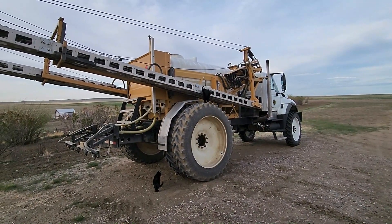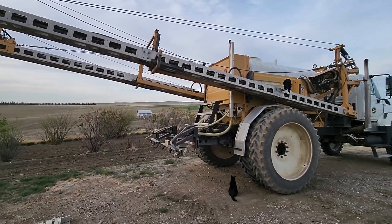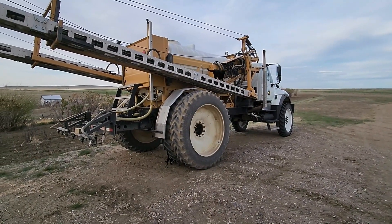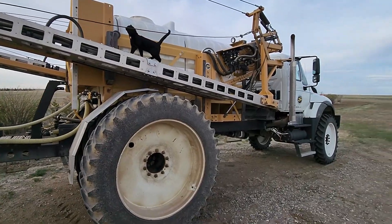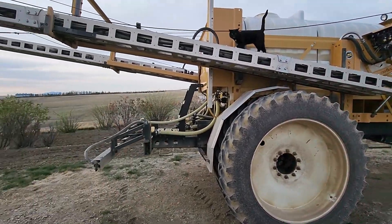We always like to just rinse the sprayer off with water at the end of the day because any type of fertilizer is pretty corrosive to metal, especially liquid fertilizer. So yeah, we just rinse everything quick with some water — and the cat's going to have to get off of there, better get down buddy — just to keep all the bolts and everything from rusting really bad. Anyways, that's sort of the gist of the operation here. If you guys have any questions, please ask in the comments. Thanks a bunch for watching, I'll see you guys later.